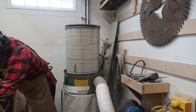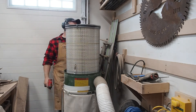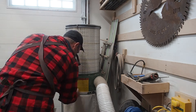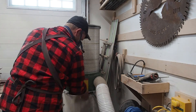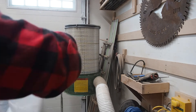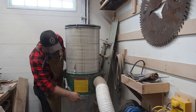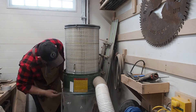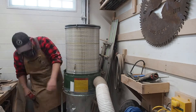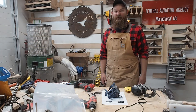Now you've got to put the top on — it's essentially the same process. I clamped the two parts together. Apparently sometimes they ship the longer clamps with the lids, and you do the same thing as you did with the bottom — just clamp to the screen. Now it's time to put the new bags on. Pro tip: use a piece of duct tape to hold the bag on while you're getting the clamp situated. It's super handy to reuse that second clamp from the top filter so there's no area without clamp pressure. There it is — I don't see any dust leaks, so I think we're good to go.